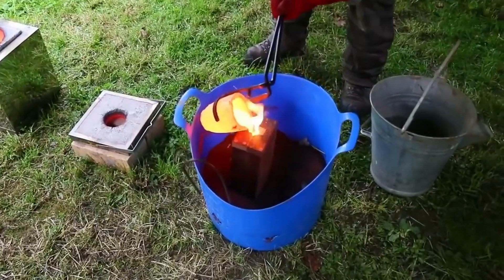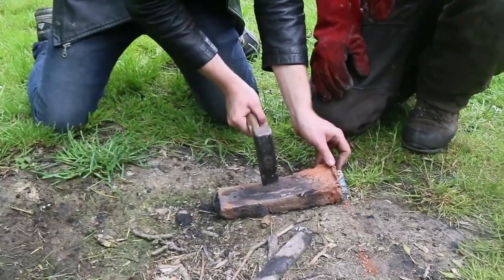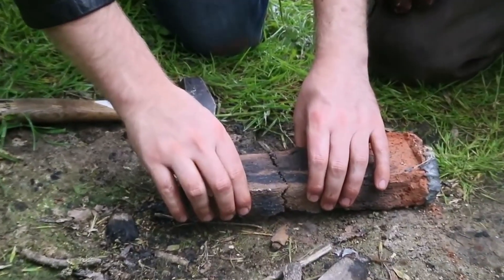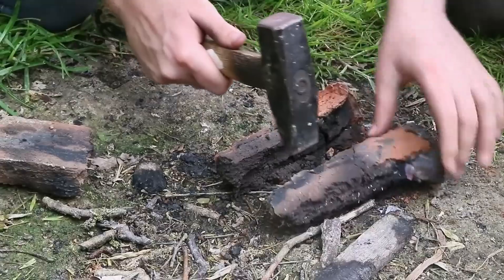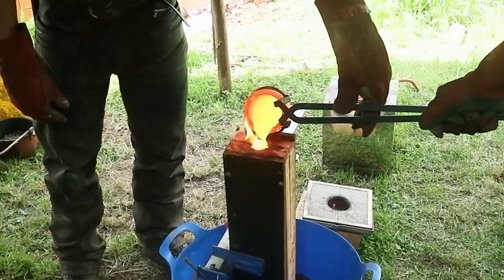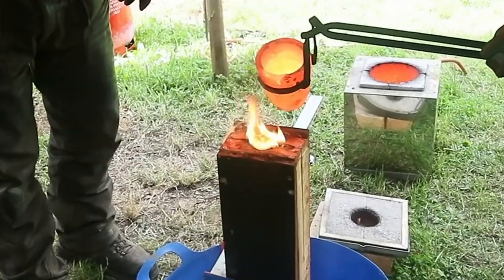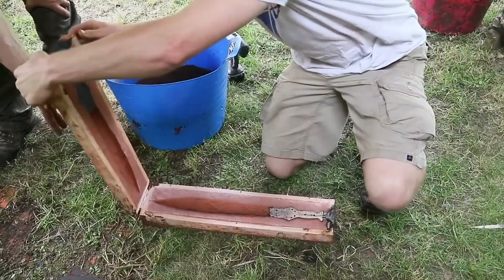ClearCast is really exciting because you can use it for lost wax casting with large prints, which means I can suddenly make things like Bronze Age axes using a 3D printer. Remember that problem with lost wax casts? They're super high detail and they work really well, unless they don't — and if the mold breaks, you not only have to make the mold again, you have to carve your wax master again. With a 3D printer you can repeat it as many times as you want. So with the printer in hand and lost wax casting on the brain, what is my first cast going to be?